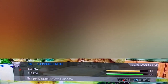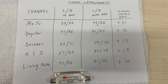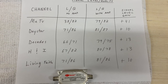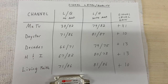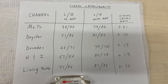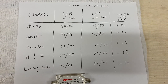Still pixelated, but we're using over 400 feet of coax cable. You can see that the signal level seemed to benefit from the amplifier much more than the signal quality. In some cases there was a significant gain made with the amplifier, but no real changes in signal quality. The improved signal levels suggest that while there might be good signal quality available at each channel, there may not be enough of it without an amplifier to get a reliable signal. Using an amplifier in some cases might be the difference between having a watchable picture or not — it might not be a bad idea to have one or two on hand in case you're trying to pull in a stubborn satellite or dealing with a long cable run.